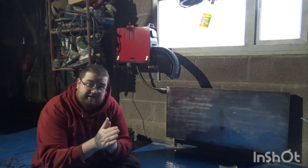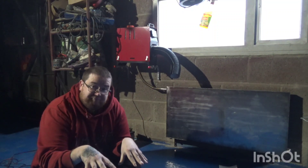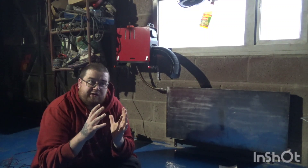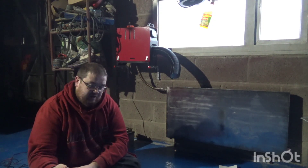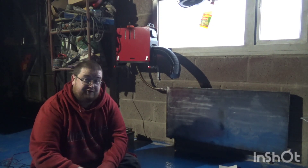Hi everyone, welcome back to the channel. As you may know, I have been struggling with my floor in my shed — like an idiot, I did it in the summer and it went wrong. Being impatient, I kind of redone it in the winter. The epoxy was fine, the acrylic not so much, and the polyurethane didn't want to set. I found out it can take over 30 days, and that's if you can keep the surface hot.